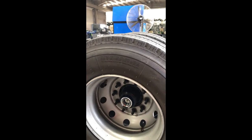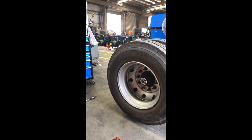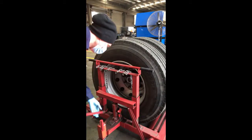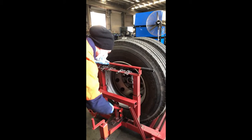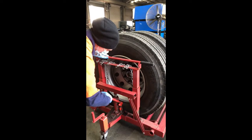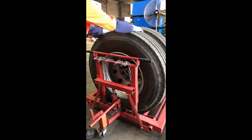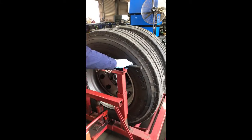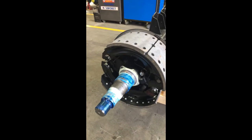Once the axle nut reaches the end of the axle thread, the entire hub can be moved away from the vehicle. If there is no further need to work on the hub, then refit the hubcap loosely and push a clean rag into the hole of the rear bearing to prevent any dirt penetrating the hub. Once the repairs are complete, the hub can simply be refitted and the bearing reset.